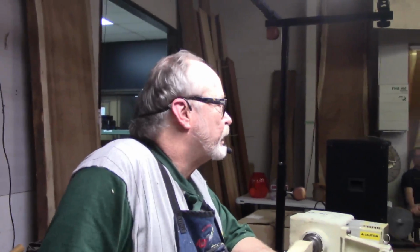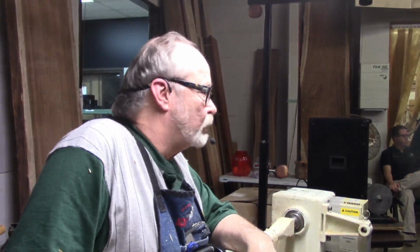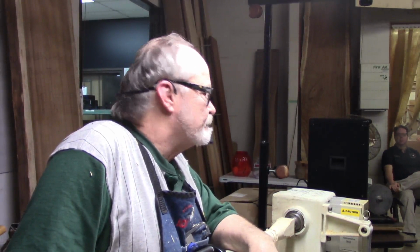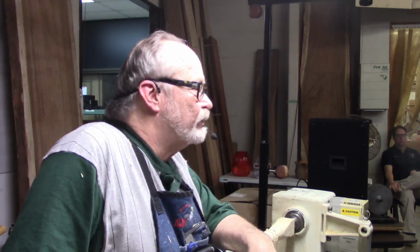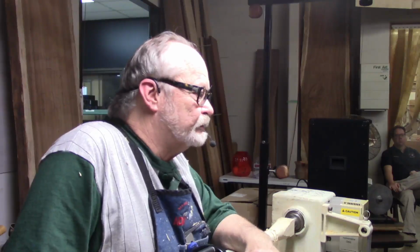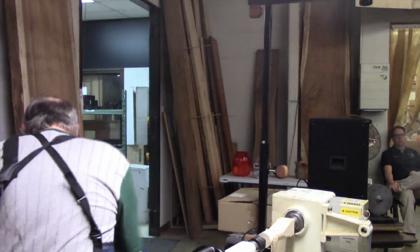If you take the class Sunday on turned lidded boxes, I'm going to teach them how to do finishing work with a scraper. I'll show how to do it with a hook tool too, but a lot of times I do just as good or better with shear scraping with fine burrs. Thought they were a clumsy tool. They can be. They can be a crutch. You can develop horrible habits with a scraper if you're not careful, but if you learn them as a refined tool, they're fantastic. They are fantastic, but it's a whole other animal. Okay, back to the Mr. Skew here.